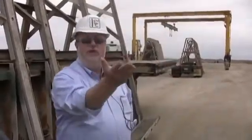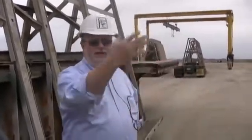No, when we strip it, normally a precast concrete panel that you see here is 5,000 PSI, maybe 7,000 PSI. We get 3,500 in 18 hours. So we're about 80%. And then put it outside, and it'll sit outside for a while, and you'll achieve your 28-day strength probably within 7 days. You arrive at this relatively high strength in a short time with different types of curing? We usually use steam curing, or we have radiant heat curing inside the building.